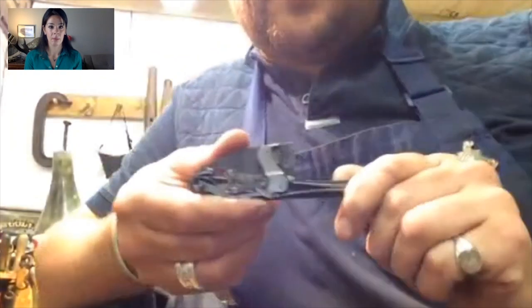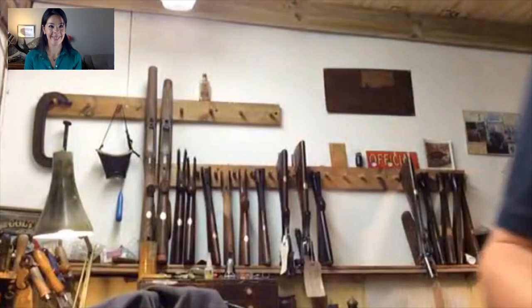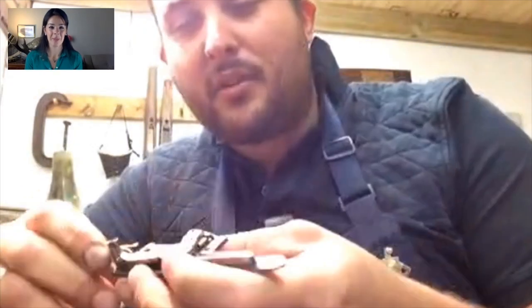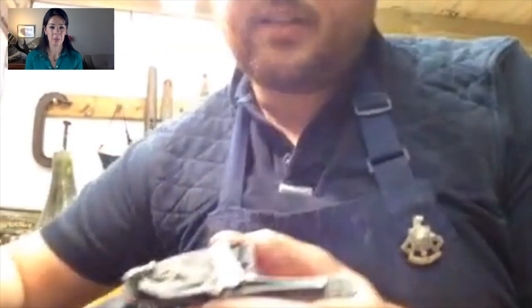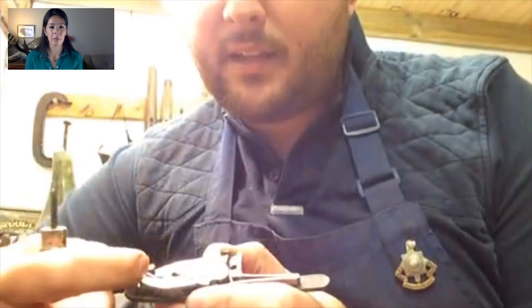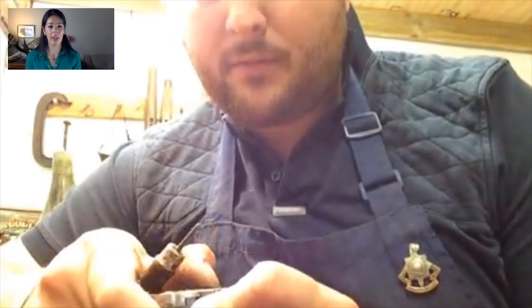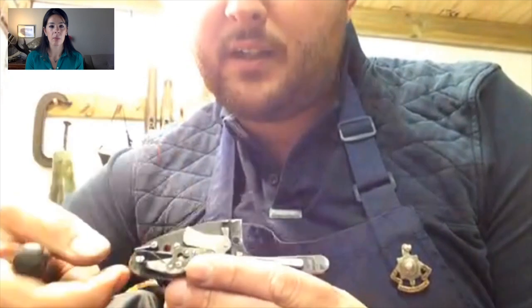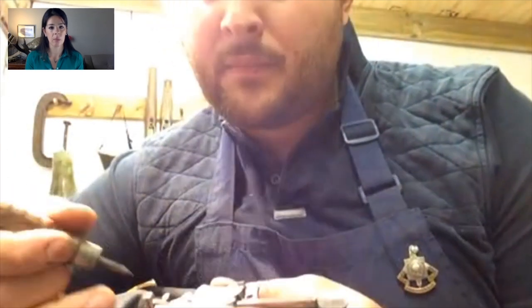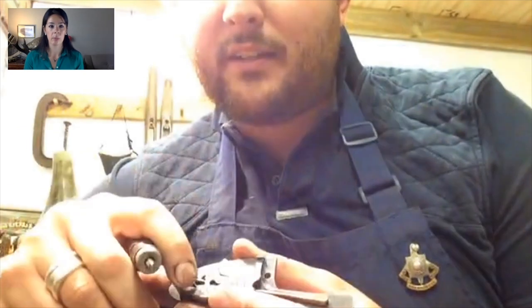This is much more the original, old-fashioned style of where guns began. The same as the over-and-under, it leads to the working parts — that's your tumbler that hits the firing pin. The trigger comes up and engages in here. The one that sits next to it is called an intercept sear. So if you drop the gun, that will intercept and not let the tumbler fall — it will sit in half cock essentially. So if the gun is dropped accidentally, this will sit halfway around and won't hit the firing pin. Accidents don't happen — it's very good safety, and it's always good to check that they're actually going to do their job.